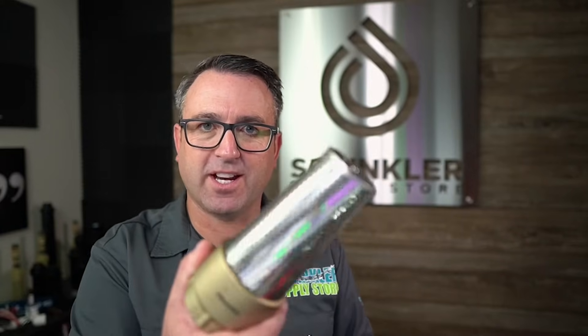There is a rough filter on this that will keep large debris out of the intake. Typically you're not going to want to set this on the bottom of the water source, because that's where all the dirt and debris is. So if you are going to pump out of a pond, you're going to set this intake above that. Oftentimes there are sleds and other contraptions used to keep the intake above the bottom of the pond so that dirt doesn't come in.